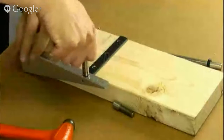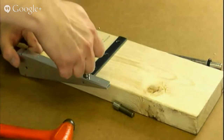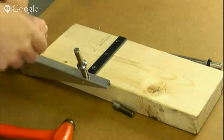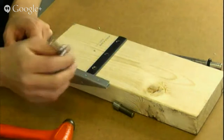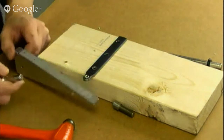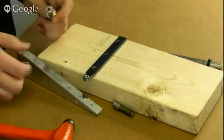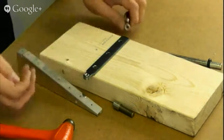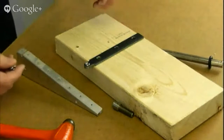If you're going to be doing it alone with a larger part, you can put this set in a rivet gun, hold the part with one hand and the rivet gun with the other, and just slowly feather the trigger — tap tap tap — not a complete blast like you would setting a rivet. But any of these methods will give you the same quality dimple.